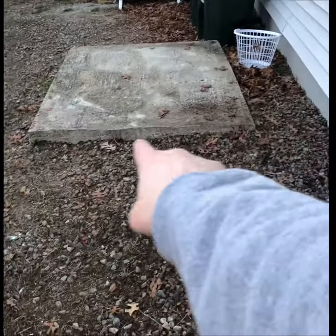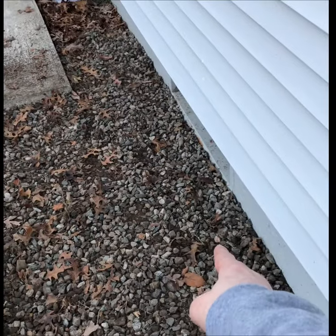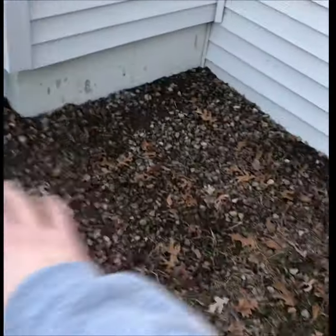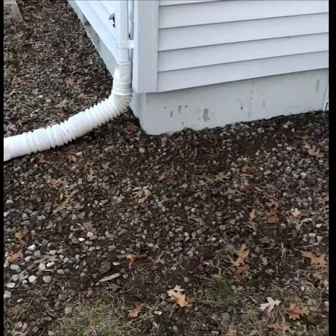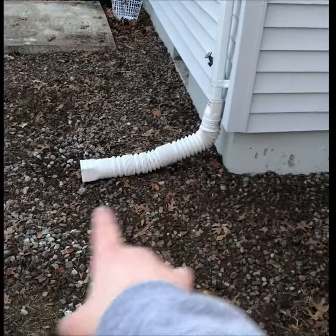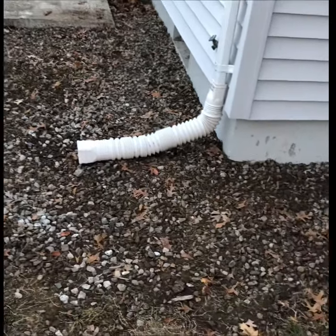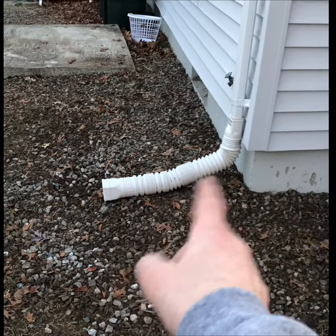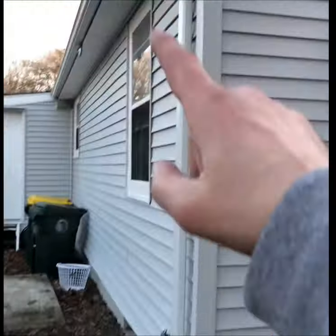I made a little valley that's way away from the problem. The problem was right here. When I had the hose running right there, I didn't have one drop of water in the cellar. The cellar opens up over there. If you use the downspout plastic correctly and make sure it works right, you would never have this problem. But what happens is the gutters fill up and go over, and the water lands right there.